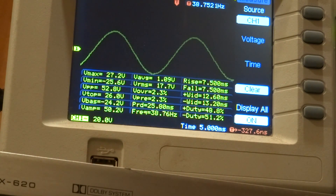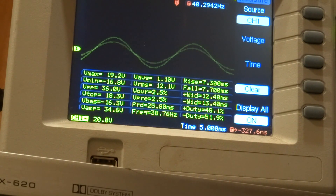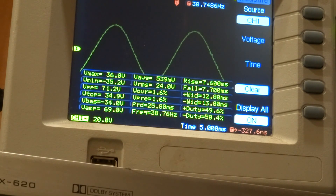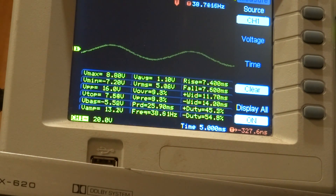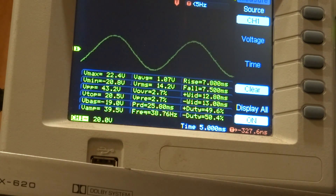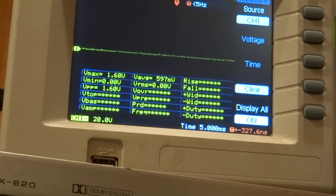It tries to do 31 volts. It's clean here, so let's defeat all of the enhancements. Okay, everything's defeated and we're at volume level 6 outputting 20 volts — I'm getting a nice breeze from the speaker. You can still clip the heck out of this thing even with everything defeated. Loudness was off. If we put the low filter on we might be able to do something. Oh yeah — with the low filter on you can turn it all the way up, but otherwise you can't. That thing is way overpowered.